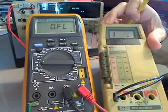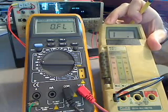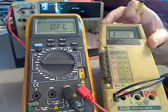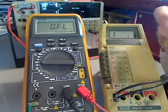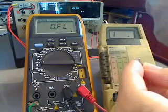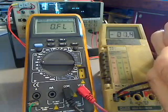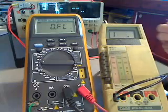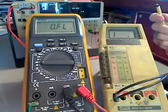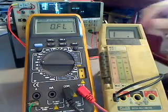Now, this is your basic handheld variety. Fluke makes better quality meters, but this one has no button to zero the reading to remove the resistance of the leads. I've replaced the stock leads with 16-gauge wire, which is much heavier. So we get a tenth of an ohm, but with the limited resolution that could be 0.05 or it could be 0.15 — we don't really know.